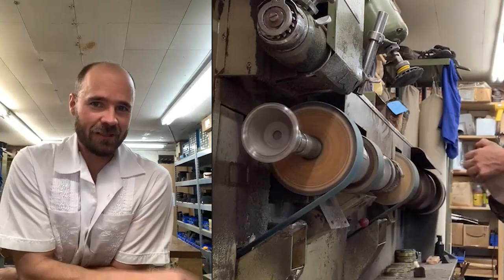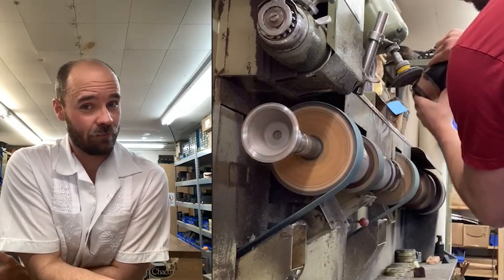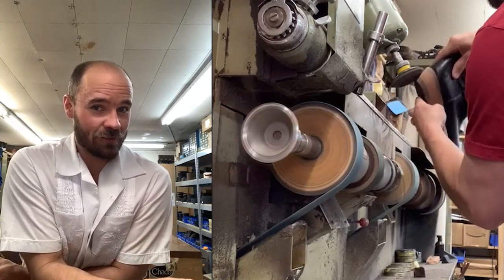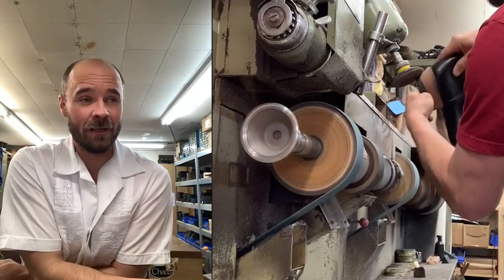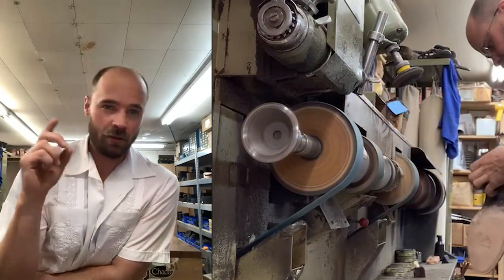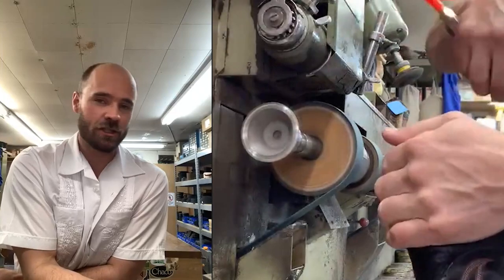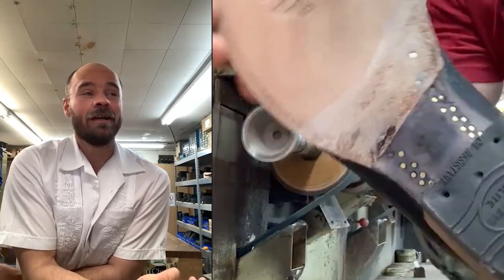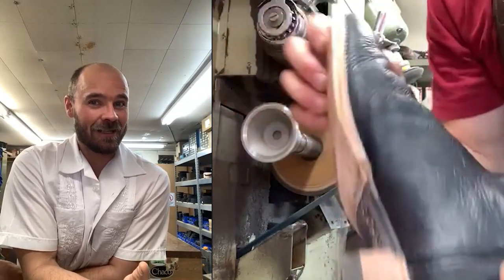Do you really need to get a half sole and then a full sole? I'd say it really depends on your use, but also on how your repair person is going to go about the job. If you're just taking one off and putting one right back on in the same spot — think about it: about the third time you stitch through a welt maybe you should have replaced the welt. It's no different from putting clinch nails in the same spot every time. At some point they're just not going to grab anything and if one of your primary fasteners is just there for show, the integrity of that repair may be compromised.